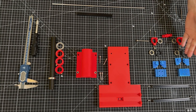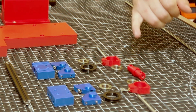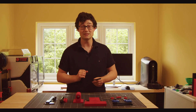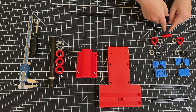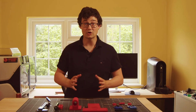Here are the sleds — one with a left-handed insert and one with a right-handed insert for the threaded rod. Sled bearings with the guide housing — I've printed this in polycarbonate as it's going to have quite high forces applied to it perpendicular to the printed layers. An earlier version built in PLA didn't really last that long. Here's the central housing with the bearings to locate it in the centre, and the threaded inserts to hold the threaded rods and the grommets. Okay, let's put it together.